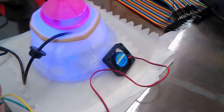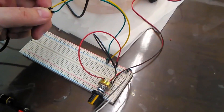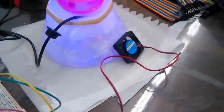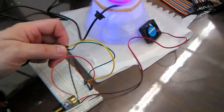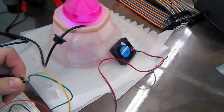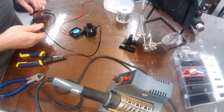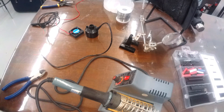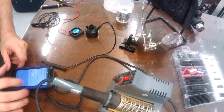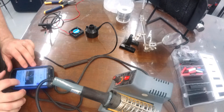There's a chance that if one of them wanted significantly more or less power, it wouldn't go to one of those channels — it would go along the short end of the circuit, hence why we call that short circuiting. So I took out a breadboard, made up a little connector, and tested it all out without splicing anything. I was even putting a potentiometer on the fan to control its speed, but in the end decided not to since I didn't get that much control. I tested it out, and sure enough they were both running off the power supply for the mister — it would work.